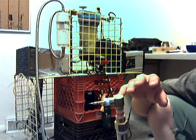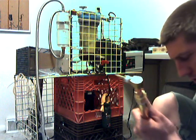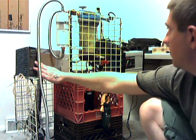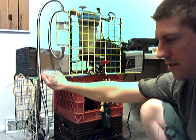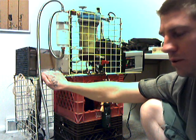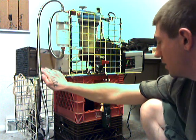Bear in mind, bronze wool does have a lifespan. If you've got a lot of water squirting in there on it, it does corrode. Also, you definitely need some way of dumping heat. If your cell's running at about 170 degrees, you're boiling water at the electrodes. Just because the water isn't 212°F doesn't mean certain points aren't boiling.